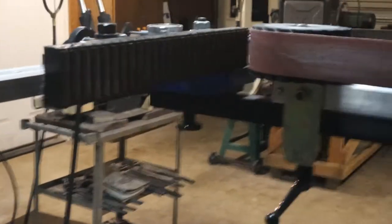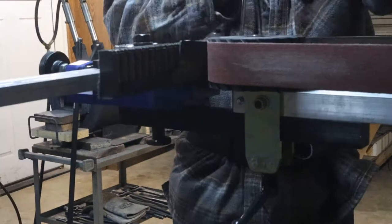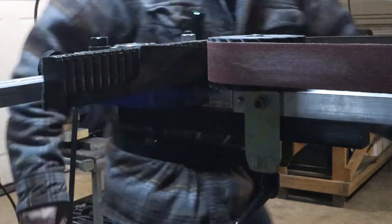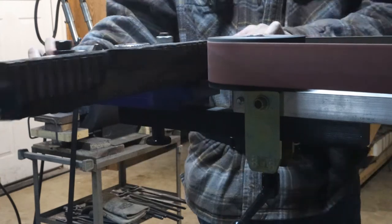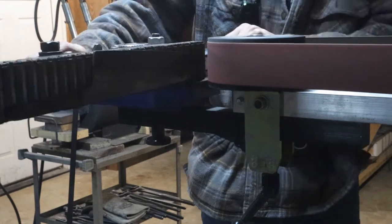And it took it out enough to where I could finish grinding out the rest of any other warp that was remaining. I could take out and grind the bevels. Here, I'm just going to take off the rest of the scale using my surface grinding attachment on my TW90. One bad thing about this thing is that these magnets are extremely powerful.